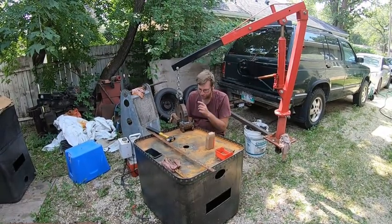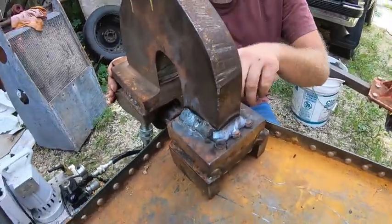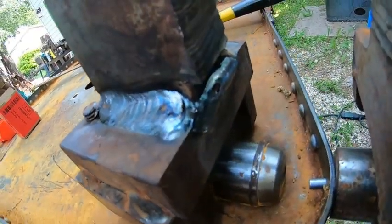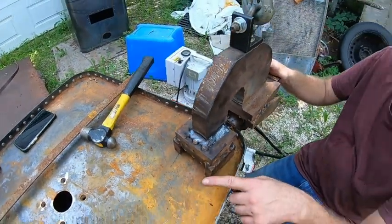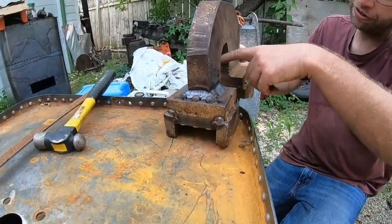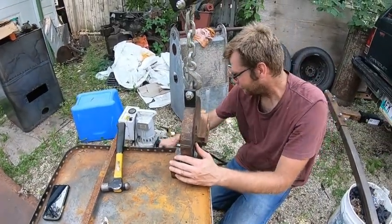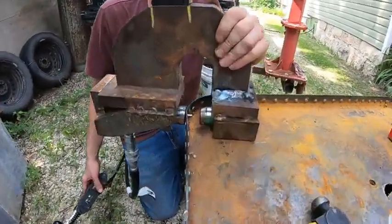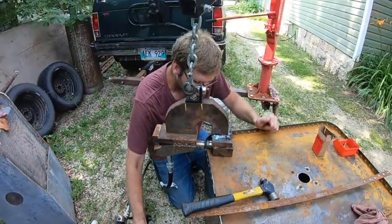Okay, we're back. We went into the shop yesterday, me and Casey, and welded it up. When I made this I didn't even bother putting gussets — I forgot to put a weld here, I don't know why. They essentially act like a hinge there, so it broke up. We pressed it back down, everything was good. When this was actually made it was welded, machined, and everything cut out and should have been in line. Hopefully the weld will hold — Casey did some of it. You ready? There we go — the weld didn't break this time.